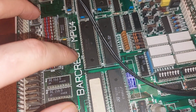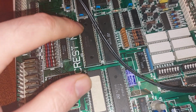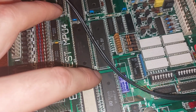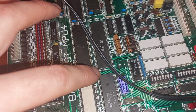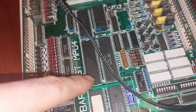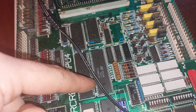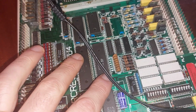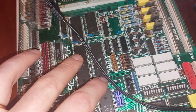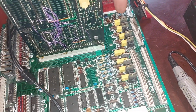That is, pin 19 on IC3 here is the reset, pin 39 is the clock data, and pin 19 out of IC8 is the clock. And they were all stuck low to start with till I cut those Zeners out, and now they're all pulsing. So these were shorted to the ground and loading these lines down. I know a couple of these chips have been replaced before, so I wonder if that's what killed them in the first place. So what I need to do now is remove those things and replace them.